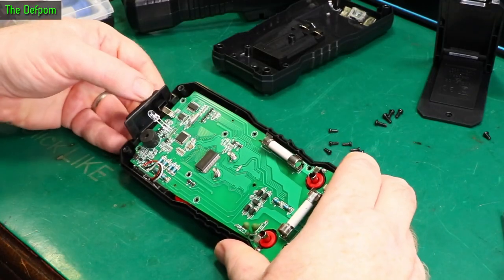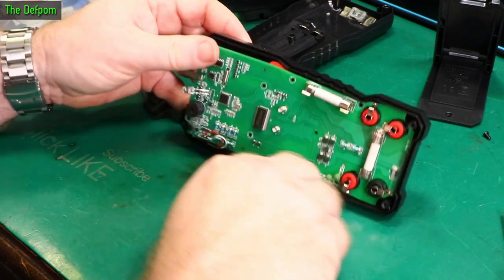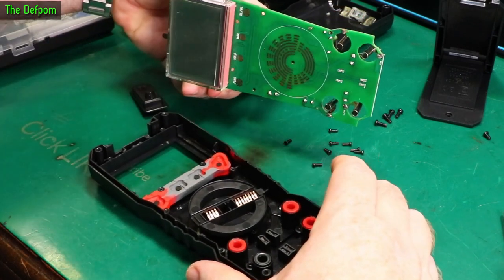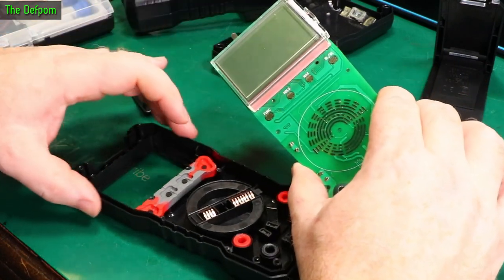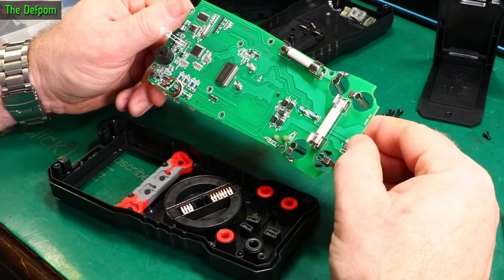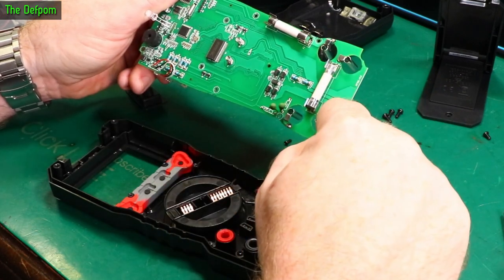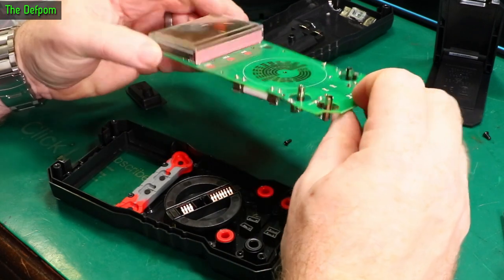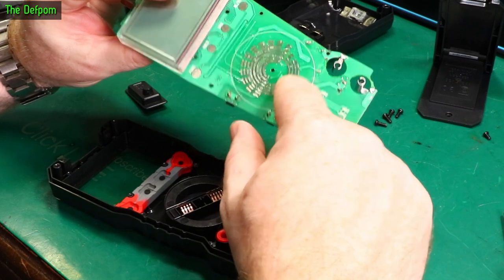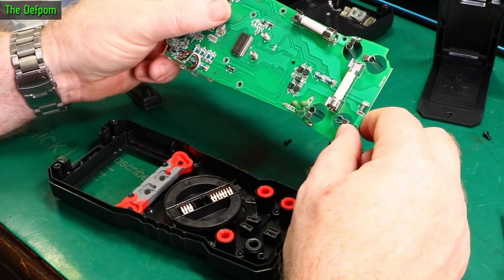A surprising number of screws to take out to remove the PCB. There's a cover for the sensor on the end. A ball bearing fell out — that's the detent for the switch. There's the PCB, not much on the other side. The amps range traces go through the fuse, back through the shunt up to the diodes. The milliamp range goes through the other fuse. So I think that's the high current shunt, and the others may be the low current shunt.